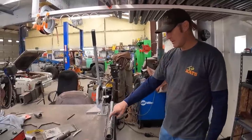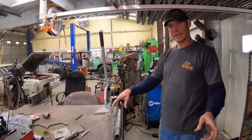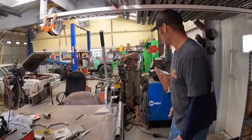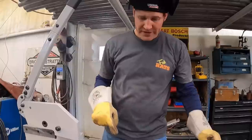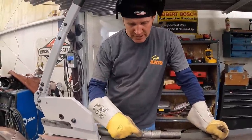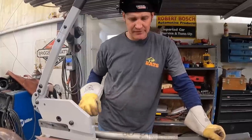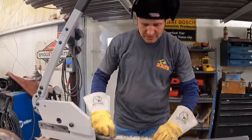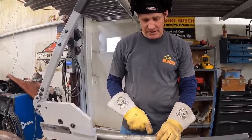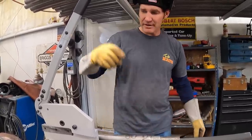I think I should weld a couple of those and then we'll have to lay it down on the flat table - get them both clocked properly and weld them together. We're ready to plug weld. The reason I used a stepper drill bit - it makes a little round circle on the outside so you can weld it. You grind these off and you can't see them anymore. Just a little trick that I use. Then we're gonna space this just barely so I can weld in between it. Weld that onto that - it'll be there for life.